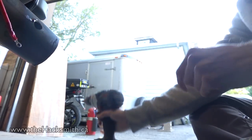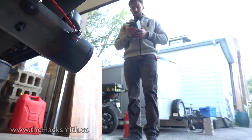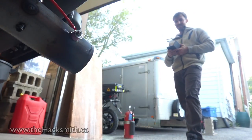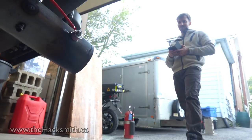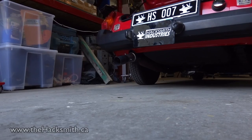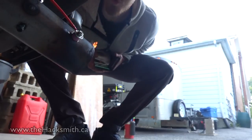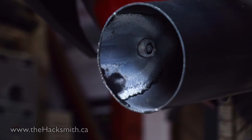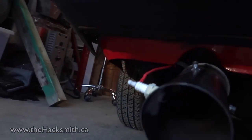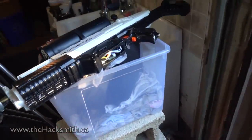I do love these drill bits. Perfect. Got this. All right, we know it works now, so we can design a better igniter. I'm not convinced it's gonna survive driving. Wide open. Okay. Propane. Frosty. So I think the issue is our spark plug has a very small spark gap, so the spark isn't very big, which might be why it's not igniting.